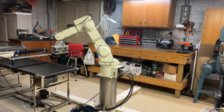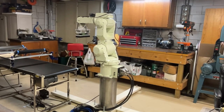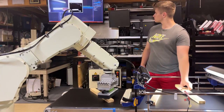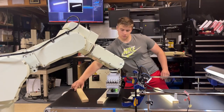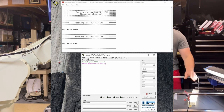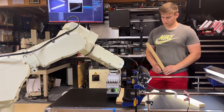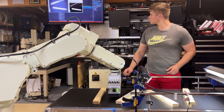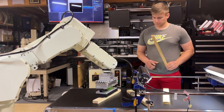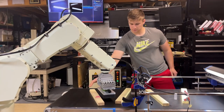In order to do this, I had to activate the host comms option on the controller, which took some firmware that I'm not allowed to share publicly. In order to test this program, I'm using the free open source program Hercules to test the serial communication, as well as a test program on the controller, and it seems to be working just fine. So the next thing was to get my program to talk to it over serial. This was actually a little easier than I expected. All I had to do was load in the system IO ports library